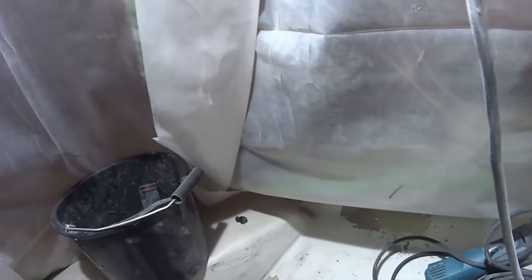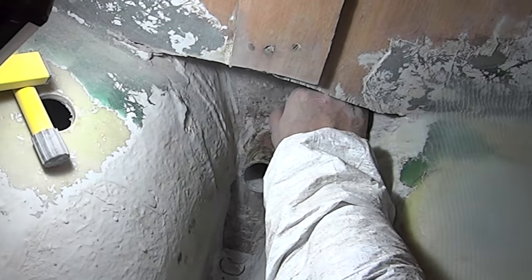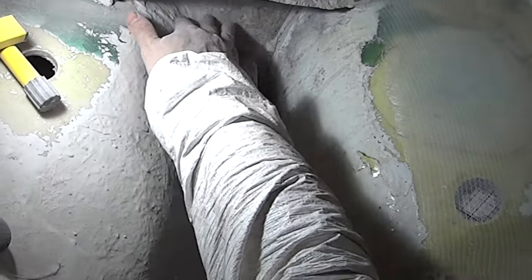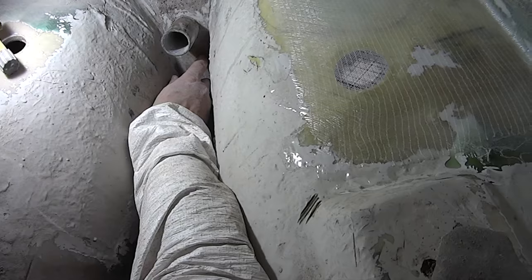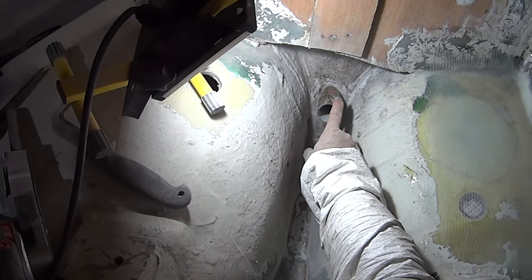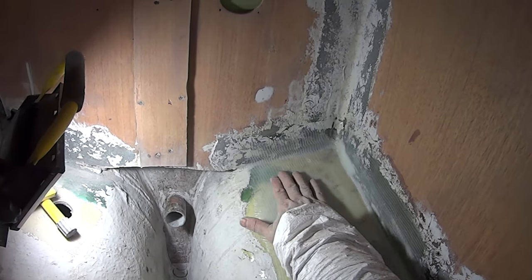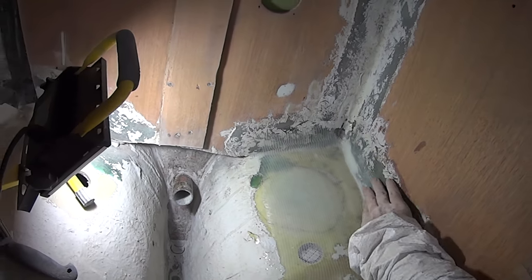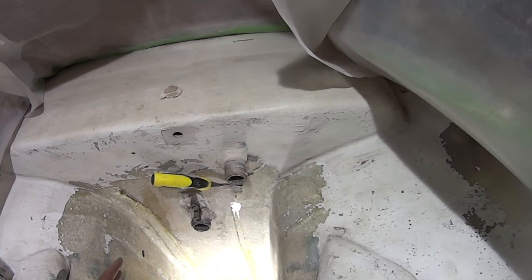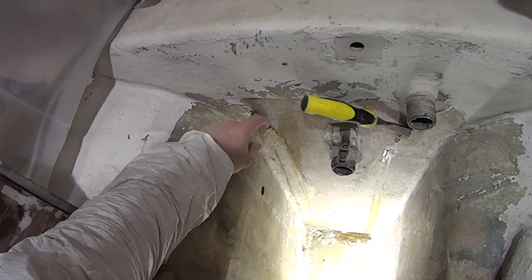Well that was a terrible job - it took a lot of different tools to get it all out. There are still little residues of wood here and there but basically I've got all the damp wood out so I can see what's going on. I need to bash this out - I'll explain why a little bit later. That's the through hole I patched up, and I put a few sheets of biaxial over it to redo the tabbing because the tabbing was a bit compromised. Then while I was just puttering around in the bilge, I noticed I could get an edge behind this tabbing - so I got a chisel behind it, and sure enough the whole thing pulled back and water came out.